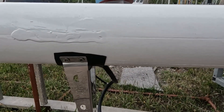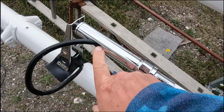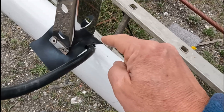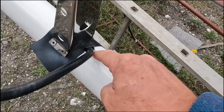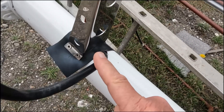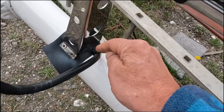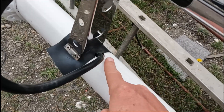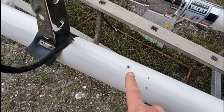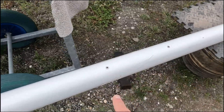I have riveted it on and put rubber — which will be trimmed — to provide insulation between the stainless steel and the aluminium mast. Here's the Wi-Fi booster aerial: a little bit of heat shrink needs to be fitted there and where it disappears into the mast, going through the aluminium into the conduit. I'm going to use a zip tie to hold this to the metal for strain relief and make sure there's a little bit of rubber as well as the heat shrink so that it doesn't wear through on the aluminium. I have rounded that hole so it is smooth and here you can see some of the rivets holding the plastic pipe to the mast.